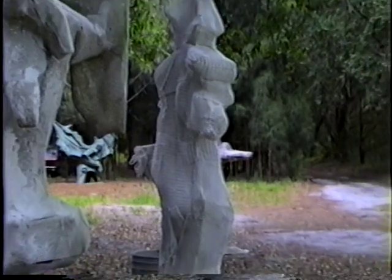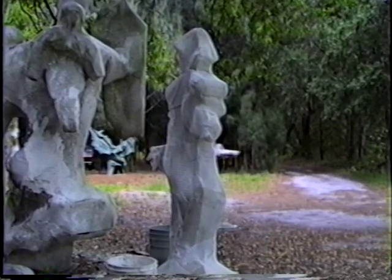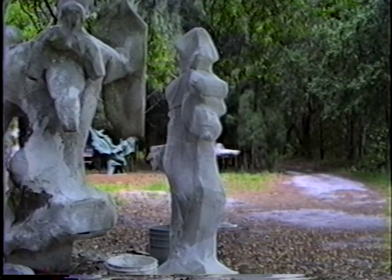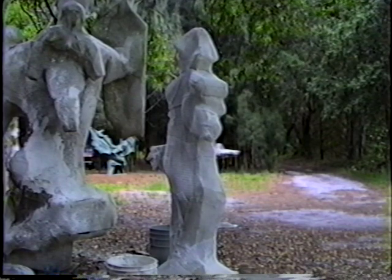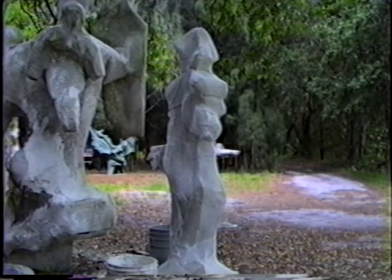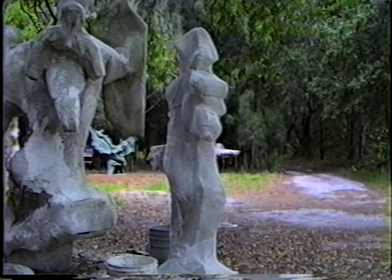And you can spray another scratch coat on it if you wish, and that would almost fill up the pores, but it also tends possibly to make it a little rough. So I'm going to go ahead and trowel into that just to show the process. Now, I have mixed clay with this next batch. It's a brown clay, so it makes a brown troweling mix, which in a way is good because it lets you know where your second coat goes as opposed to the first coat.